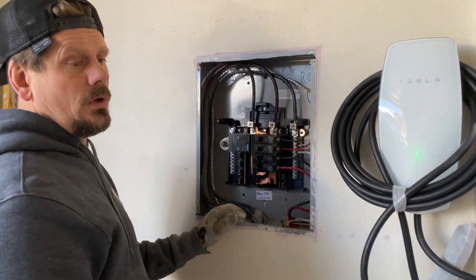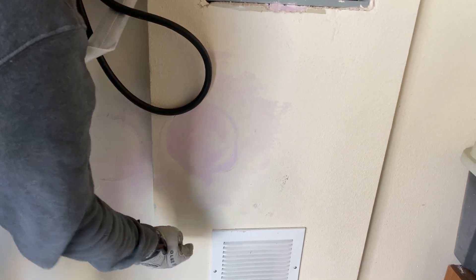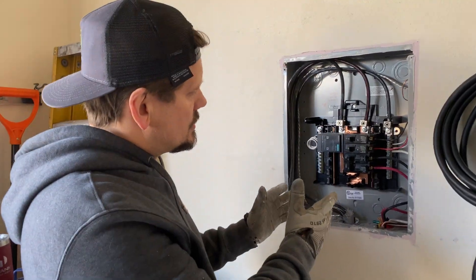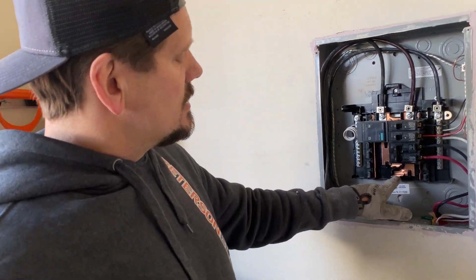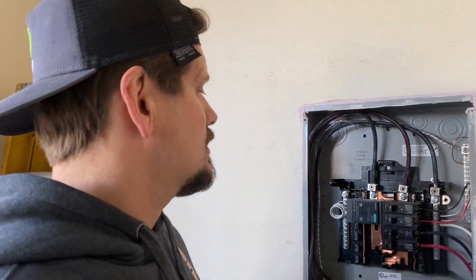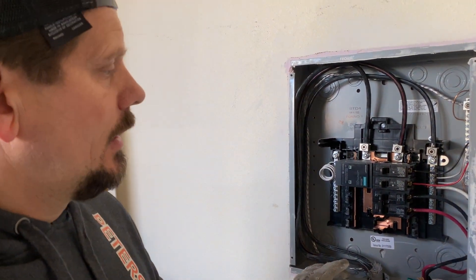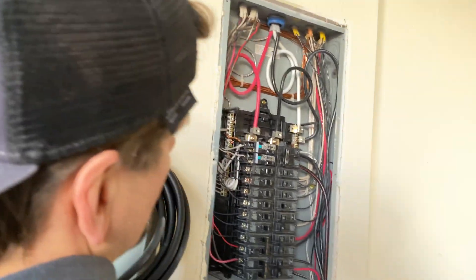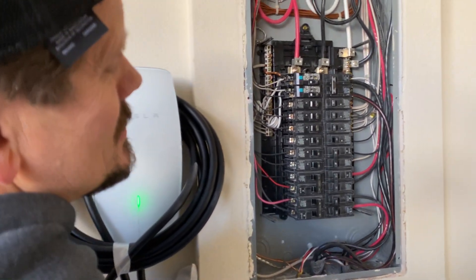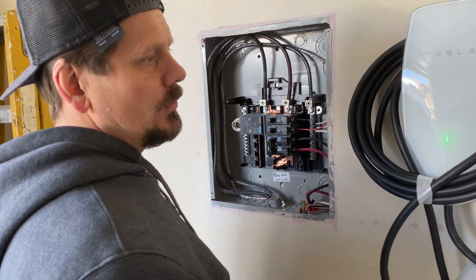We had to drill through all of this wood. Once we did, we had a six gauge wire up, a yellow 12/4 wire here, and then the SER through — had to have a large enough hole to get through. This is not a two-by-six wall; it's a two-by-four wall, which was a surprise. This house is 20 years old — they have gone more to two-by-six walls on garage firewalls and exterior. We mudded it all, got it put back together, and tested it — it's working great. She still has space. This is a typical breaker panel that has the teeth so you can quad it up. You cannot quad up a surge protector, but I could take this out and put one on the main disconnect out there if I wanted more space. This panel is a 12/24. This house was definitely wired in 2005 — that's when those old-school Siemens teal arc faults came out for just the bedroom. We're not going to arc fault that today because you move the wire about three feet anyway.